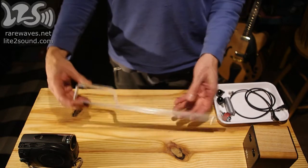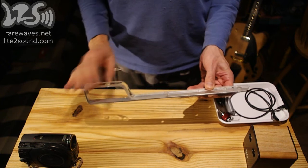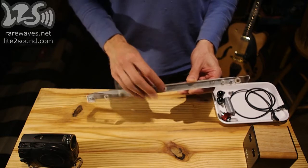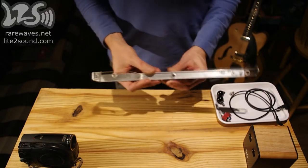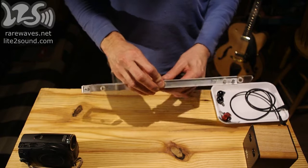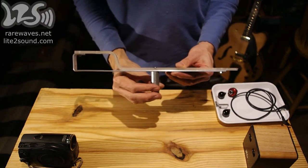The basic part is this bar which has holes on both ends for mounting the camera and the photodiode amplifier. In the center of the bar there's a third hole, and that's where we attach a post at the center of balance of the bar. The post simply screws on, and later we'll use that post to attach a hand grip. And now you can see where we're going with this.